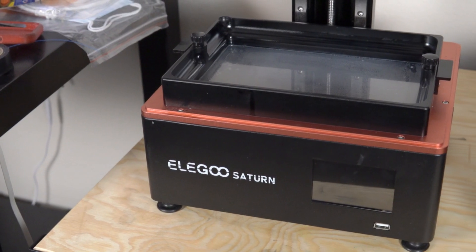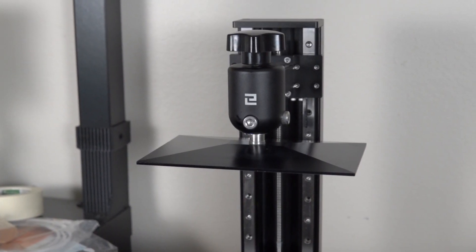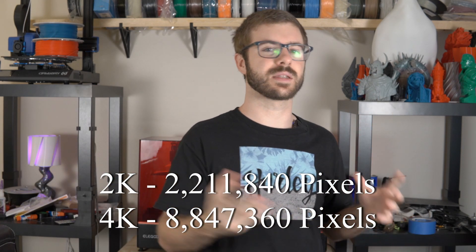I was really happy with the 2k LCD screen on the Elegoo Saturn — I thought the quality was impressive and considering how large it could print, the prints turned out phenomenal. But Elegoo announced that on their final version it's actually going to have a 4k panel. With a 4k panel, the pixels are four times the density of the 2k panel, which is going to be a substantial bump in the overall quality and detail the final released Elegoo Saturn will be able to produce.